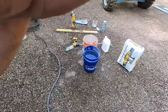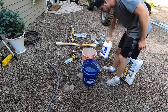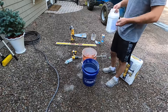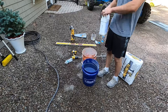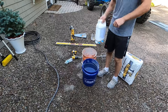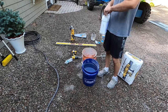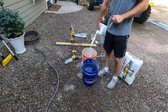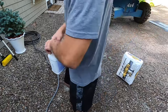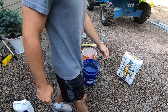I start with about a quarter bucket of water. For the bonding agent, I do a six-count for my bucket size. I shake it up a little bit first because it separates — kind of like oil and water. One, two, three, four, five, six. Then with that quarter bucket of water, I do half bags at a time.